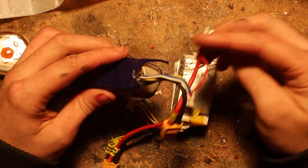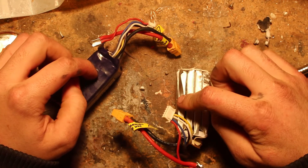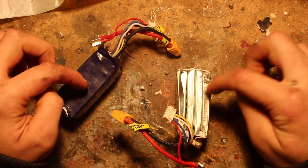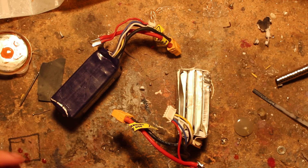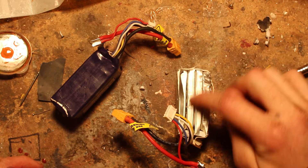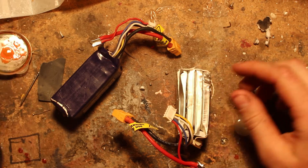I've got this battery that's done the same thing. We'll cut one of these batteries up, take one of the good cells, add them to the other dead battery and make two dead batteries into one good one. Because there are three good cells in the cut-up battery, we should be able to fix three other batteries with it.